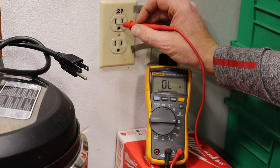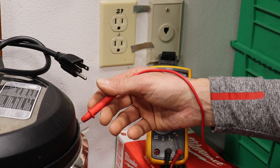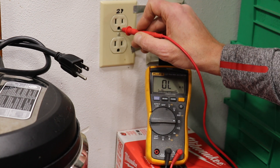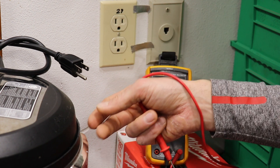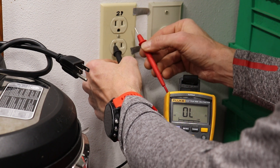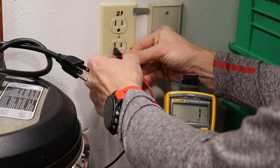Back at the electrical panel, the grounding conductor and the neutral conductor are bonded together — they are physically connected. What that allows is if we have an electrical short within the device, that shorted power can come back through that grounding pin, through the grounding pin in the outlet, and right back to the electrical panel — to the source — instead of through me to ground, causing an electrical shock. For demonstration purposes, we can see there is continuity between that neutral and grounding pin with my multimeter. So back at the electrical panel, they are bonded.